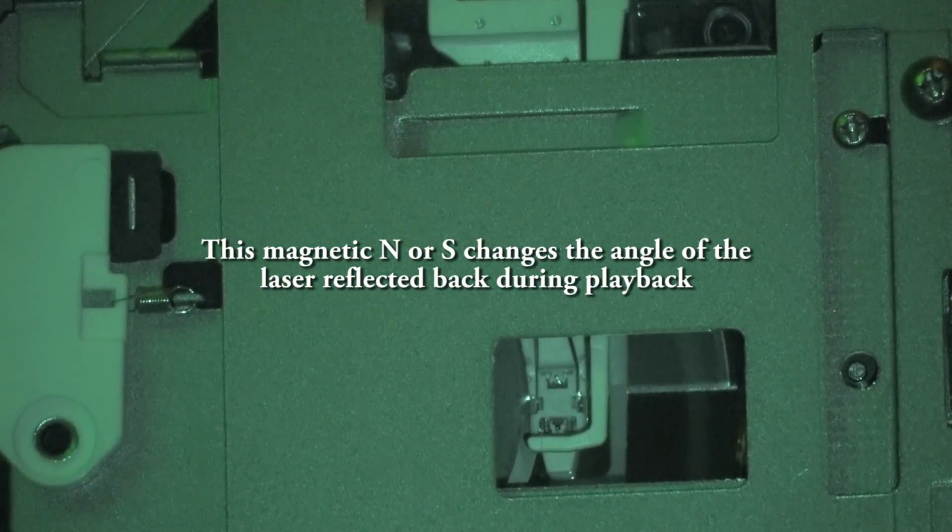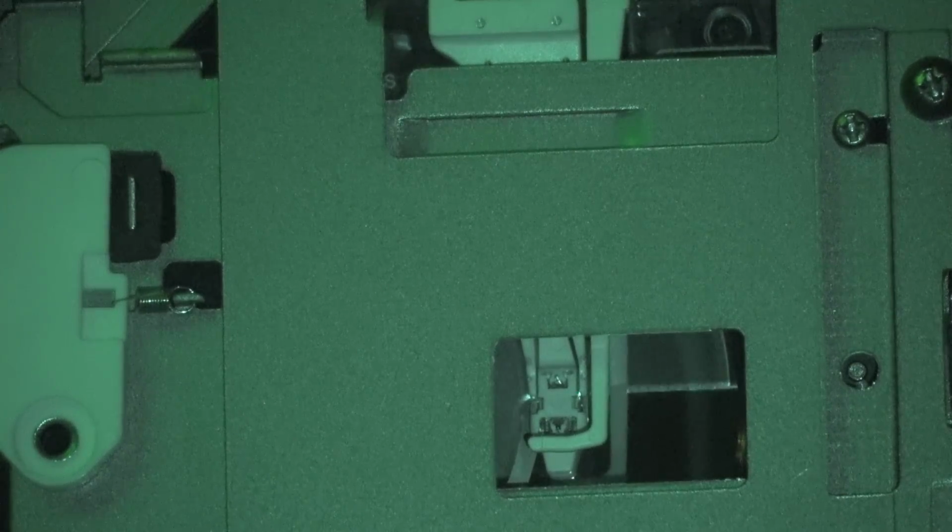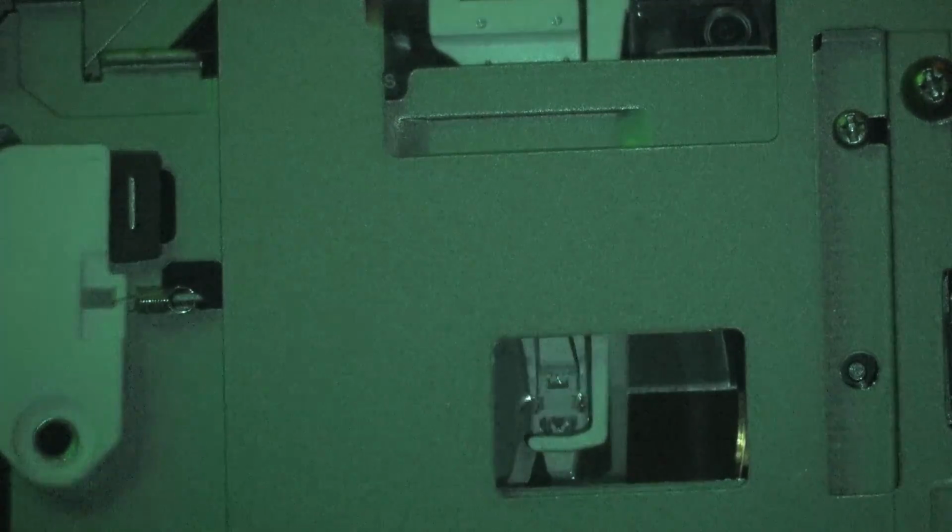So it's buffering the data and it's recording it and then stops. Records, stops, records, stops. So that you see the laser kicking on and off there. It's an infrared laser, that's why I had to put the camera in night shot. And if I block out the infrared emitter from the camera, that shows probably a little clearer, because now the light you see it's still running all the time. It's just pulsing into the higher power mode.